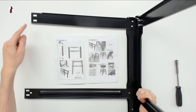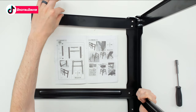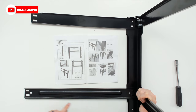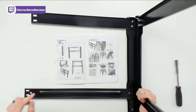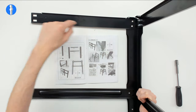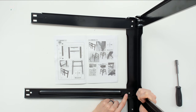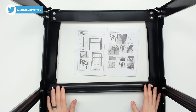Now we're ready to attach our A pieces. We have two different A pieces right here — a shorter A piece up top with a short metal lip at the very top, and a longer piece at the bottom with the shorter side at the top and the longer side at the bottom. We just need to attach it to the frames we already built. Take the nuts, washers, and bolts and slide them through — two on each side, so four up top and then one on each side at the bottom. Now we have it installed for both sides and we need to repeat that step for the other side.